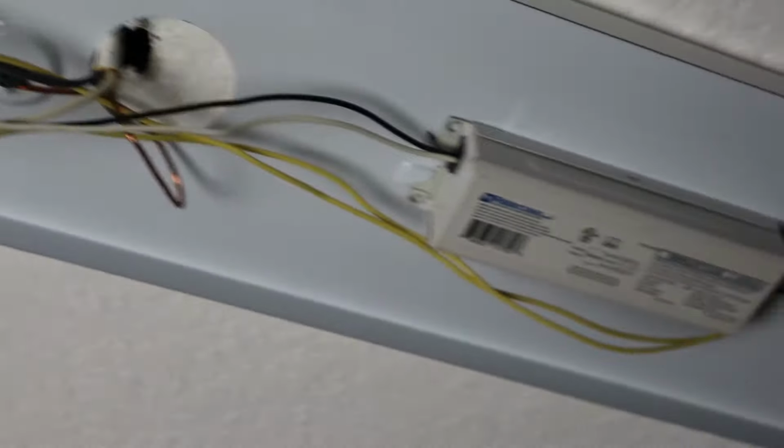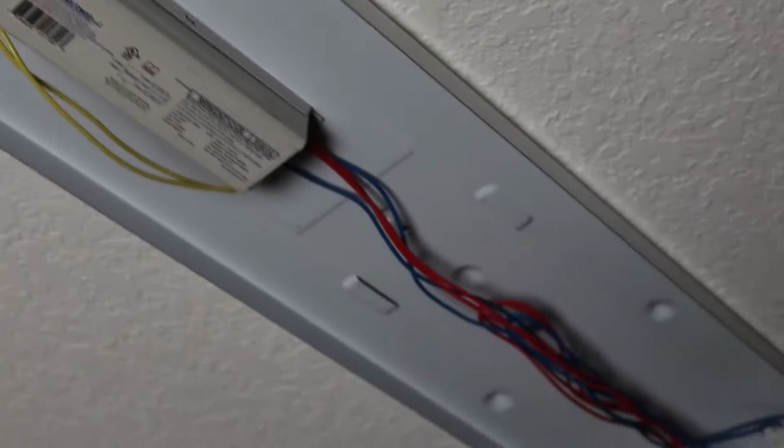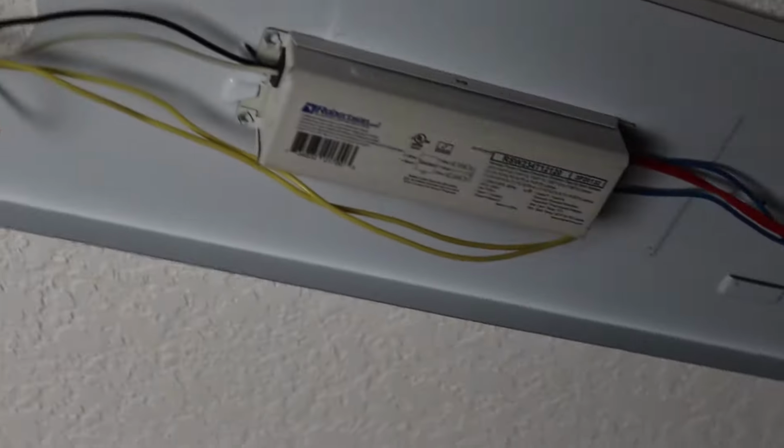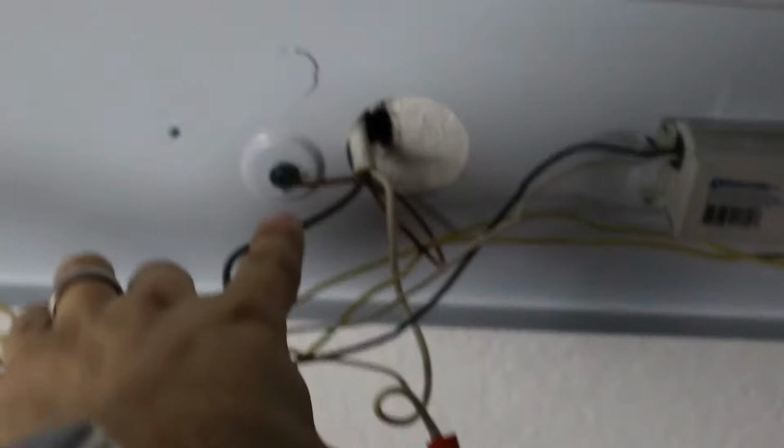All right, so most of these ballast lights are the same. You take the bulbs out. Obviously, make sure you turn the power off to your lights, which I've already done. Take your bulbs out and do not throw your bulbs away. But your ballast is basically going to be about the same. Here is obviously the hot wire and the neutral wire coming in, as well as the ground. The ground is right there. All right, so a traditional ballast bulb is going to get power from both ends of the light. These Sunco LED bulbs, really only one side of the bulb is hot, and one's going to be the hot pin and one's going to be the neutral pin. And so we have to sort of rewire the whole area up here in order to make that happen. And I'll show you what we're going to do.